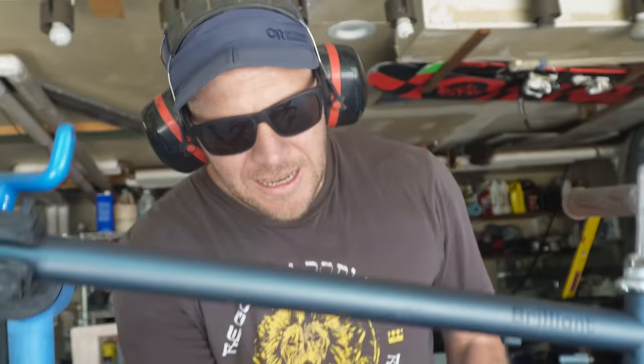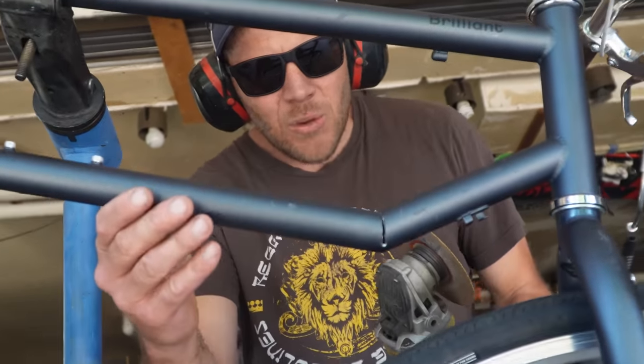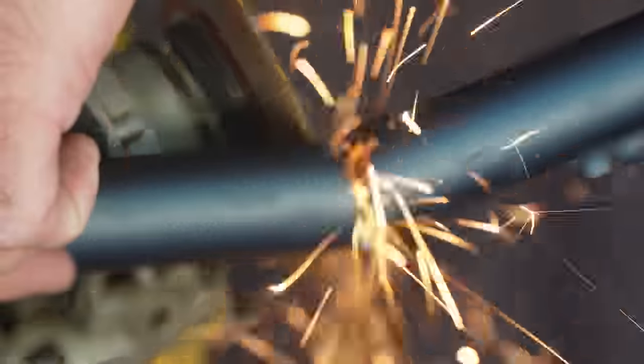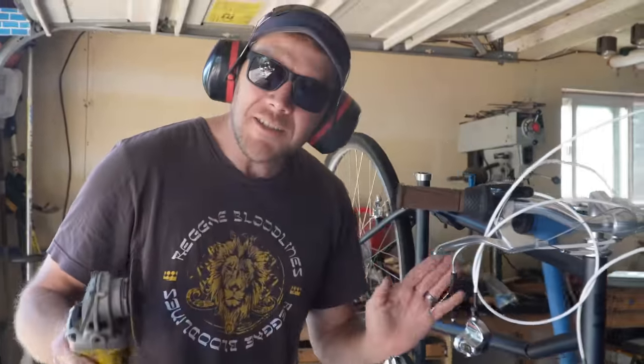In order to do that, I'm gonna take off a little more steel so that we can bend it up higher. And one thing to note is that, you see how the tubes are in alignment pretty nice? You want to make sure that you take off some material on both sides instead of just cutting out on one. Otherwise, when you bend them in, one side is going to be overlapping the other. I just took a little sliver off the one side, just the tip.